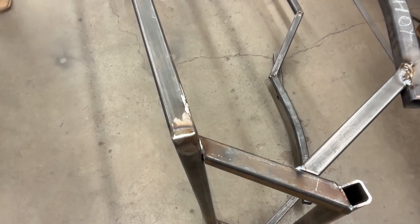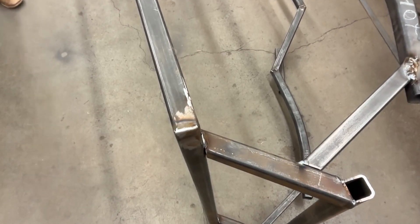A bit of both, but we're mostly contouring the frame off the body so we have a couple of anchor points. Can you get a close-up and let's take a look at your work? You're getting there. Jeff asked me early on why square chassis, and I said, well, that's what the original plan had — to work on a square tube chassis. Because it doesn't have to have the strength that a Monster Jam truck does when it drops out of the sky, the square chassis works out great. And you guys have certainly learned how to weld really well on that square tubing. It's a great starter process — you're really making progress. It looks great.